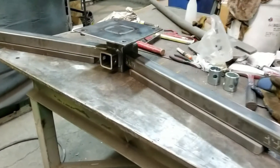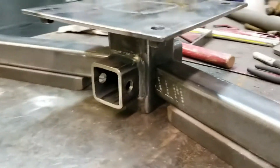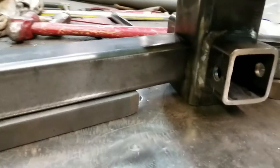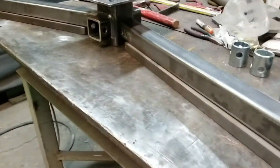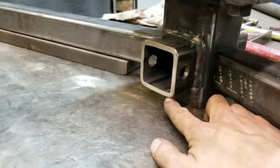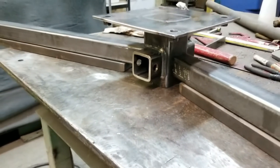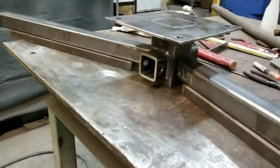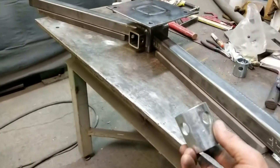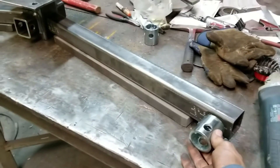I've cut them on a 25-degree angle because I didn't want them coming out square. They're raised with a one-inch bar there, which makes it a lot easier — one inch matches this distance because that was set at one inch. After I've welded these on, the next thing are these stubs that the jack goes on, and those will be welded somewhere here, something like that.